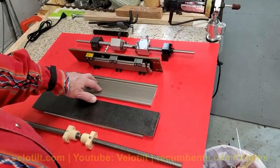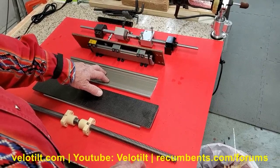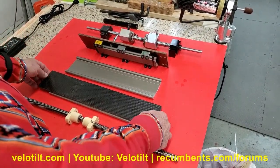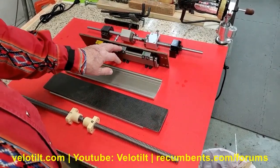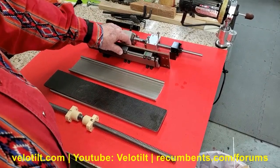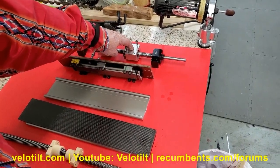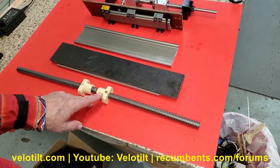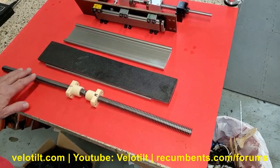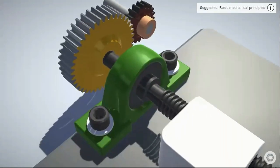This is the original igus.com unit that Wim had started with in the VeloTilts — I still use it nowadays. igus.com from Germany sponsors VeloTilt. A new unit just came this morning. Originally they had four railroad cars on this railroad track, so I put six on it. This is a mock-up. These are ball screw nuts with ball bearings in them, but igus has the best — these are just plain lead screws with no ball bearings, they don't need oil, nothing. A left thread and a right thread. We're going to show a 20-second animation video of this experimental tilt unit.